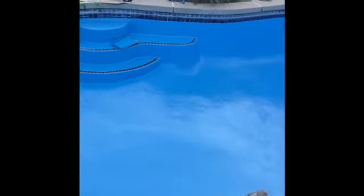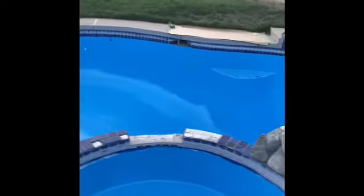But yeah, this is the end result. This is what the surface of the pool will look like. We still have to add some tiles here and do a couple of things to finish the swimming pool. But other than that, the flooring and the walls have been restored and repainted. We started with the initial concrete, and we added the second part, which was the epoxy primer, and lastly we finished with the final Ultra Seal brand epoxy paint, in the color Blue Haven.